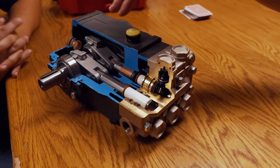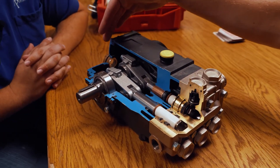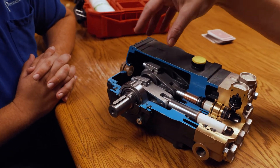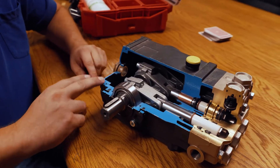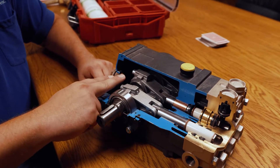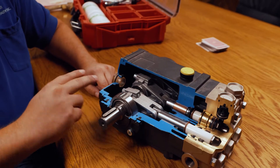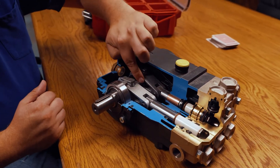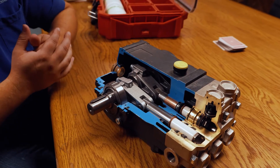As far as some of the components, let's start at the back of the pump. You've got this big space here — is that just an air gap? This is normally filled up with oil to about this level, and that's going to lubricate. As the oil lubricates, it keeps all these components from burning themselves up from friction.